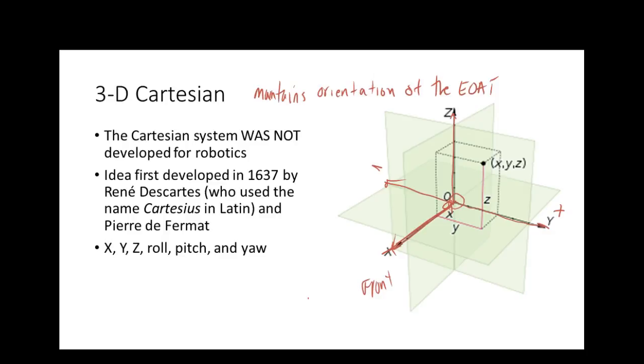So now you won't be concerned with which axis to move. All you're concerned with is which direction you want the robot to go in. Normally when we jog the robot, we jog it in one of the Cartesian systems. The only time we use the joint is to reorient one or two axes. So very seldom do we use the joint jog, because you're responsible for 6 axes. That makes sense? So we have 6 keys. We have X, Y, Z. So the keys turn from joint 1, joint 2, joint 3, joint 4, joint 5, joint 6 to X, Y, Z. You have 2 directions. You have plus, you have minus. And then we have what we call roll, pitch, yaw.